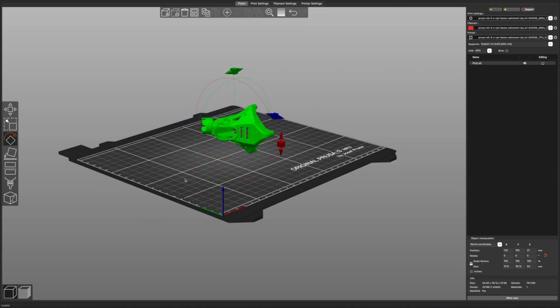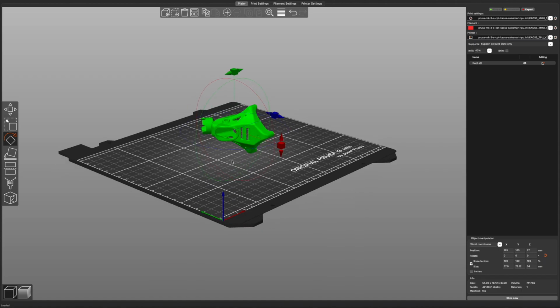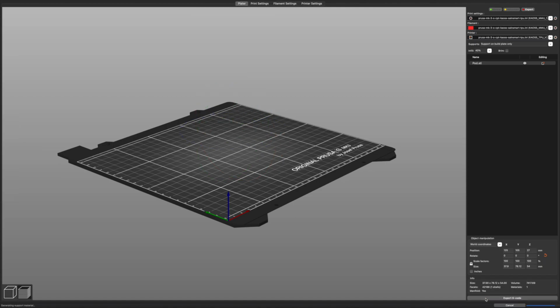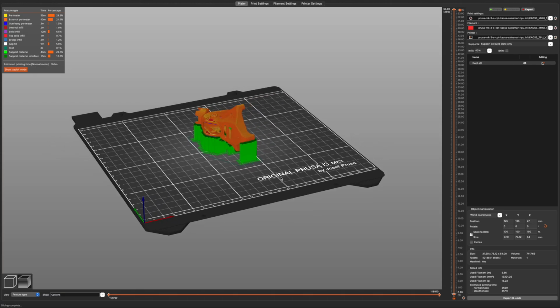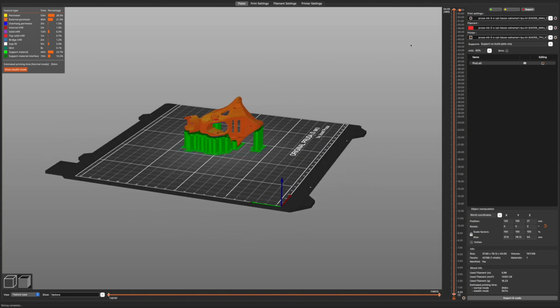You're going to figure out what the distance is, or how long the print is going to be for the stripe in this case. Mine's going to be 6 millimeters. You can go ahead and slice the model. That's going to take you to the layer view. This slider here is the key. This is telling you the height of the model. So in this case it's 54 millimeters.